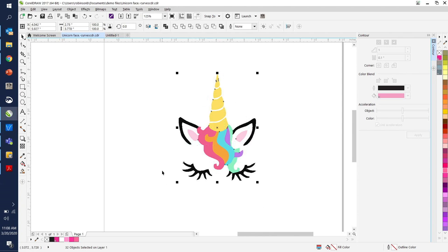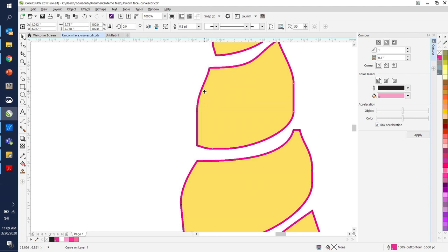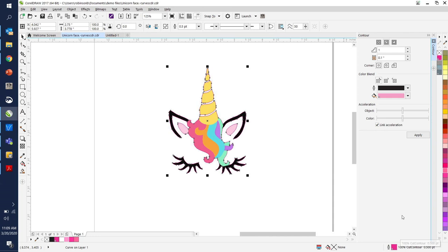Once create boundary runs, I right-click and choose the cut contour spot color. It changes the line from black to that magenta type of color, and I can confirm at the bottom it says 100% cut contour. This is now ready to export. Unlike regular CAD cut, we do everything in a positive here — almost everything we're printing onto is a white material. The inks in this process are translucent, so they don't have opacity in themselves. We need to print onto white material so the color doesn't show through.